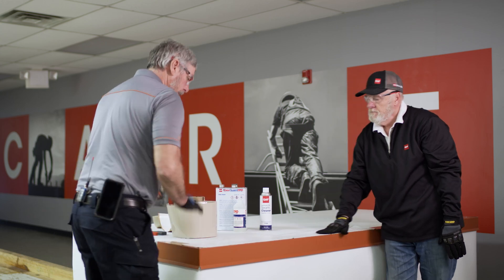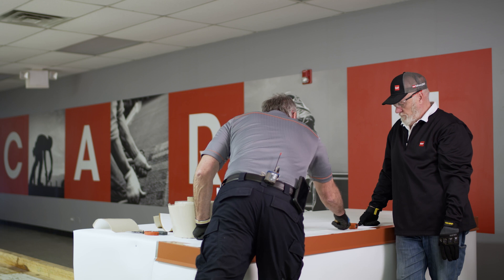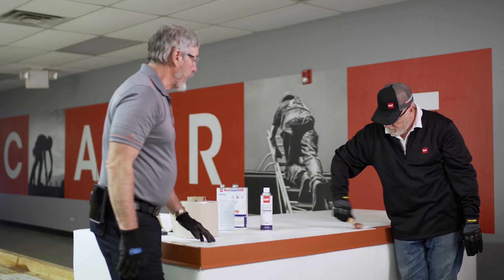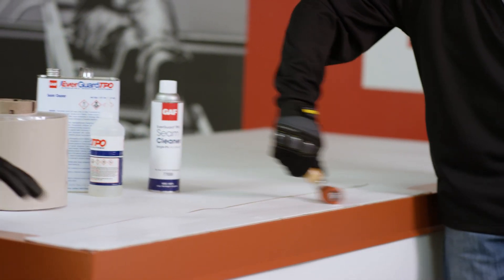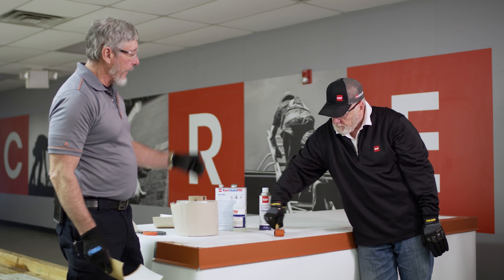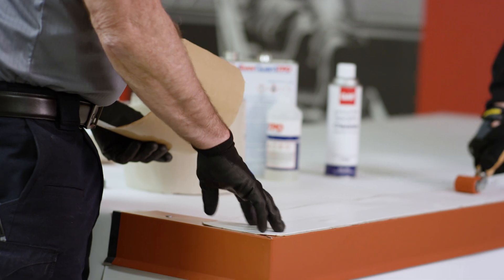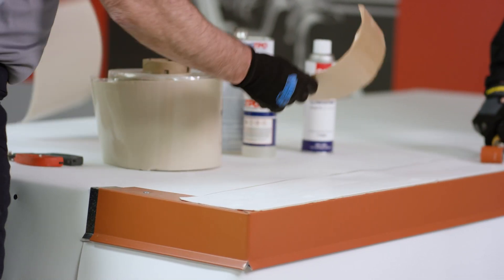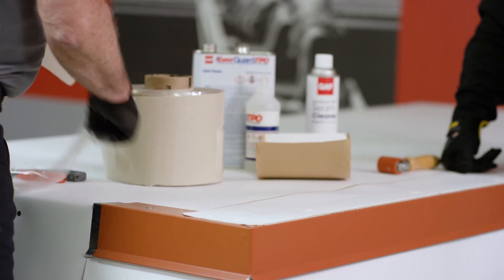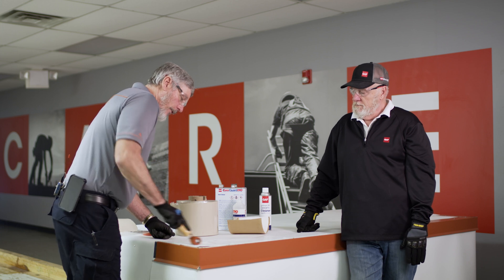Set it. Is there any certain way you'd like to see you guys roll this out — at 45? 45, that's what they do now. So again, we have a tape overlap here — if you can visualize maybe we're doing a couple hundred feet, like this is the end of my run, or I got an inside or outside corner. Again, we do not need any primer on this, so I can take the primerless cover tape and just overlap that. You can lay it in, roll it — that's pretty much all there is to it.